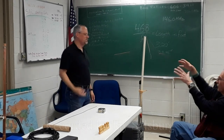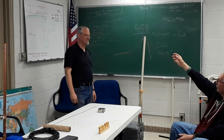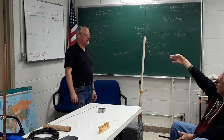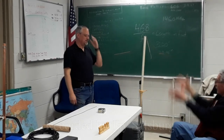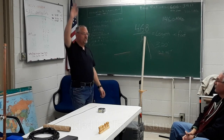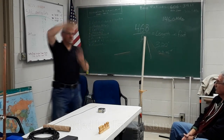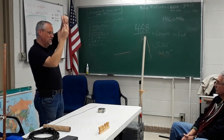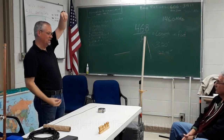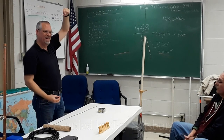Variation on that. When you brought your elements down, you're simulating a skirt, and a lot of people have done it successfully. You take like copper tubing at about a quarter wavelength. Yep. And it goes over the top of your support mast. How many of you have built the coax cable antenna that has a quarter wave come out the top, and then the shielding gets folded back over it? Yeah. What a pain in the butt antenna that is.